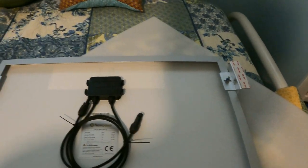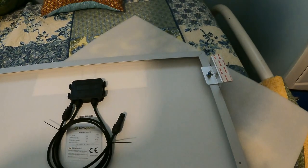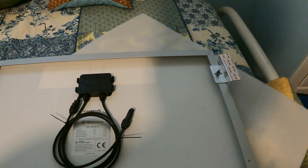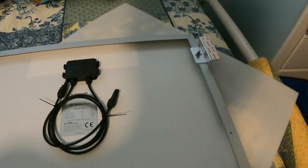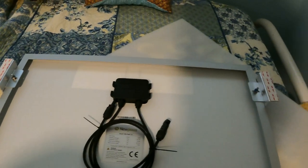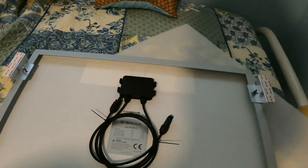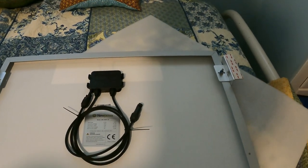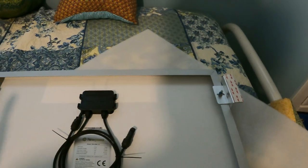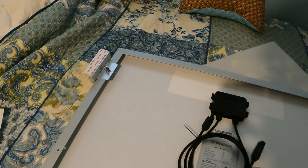We decided that this is a 100-watt panel and we're not going to be running our air conditioner with this with our current battery or this panel. And that's not the intention. We do have a 140-watt ZAMP panel that we have used on trips. And we have one Battleborn 100-amp-hour lithium battery. And we've kept track of how we use our power, and we have decided that we don't need lots of batteries or solar power at this point. Maybe someday we'll do something else where we can run our air conditioner while boondocking, but that's not what we're going to do now.